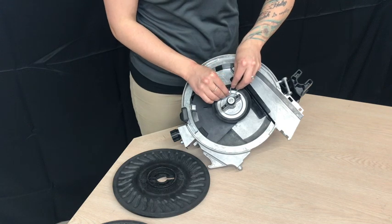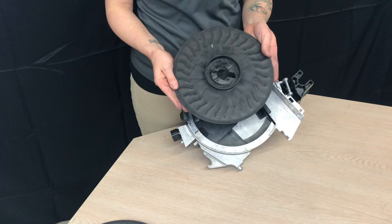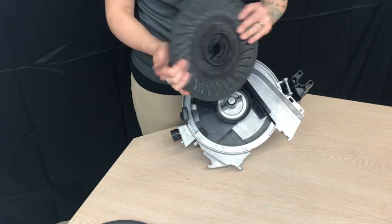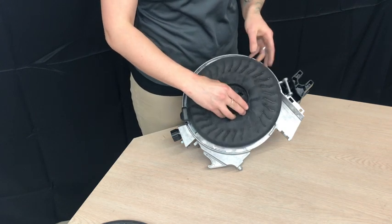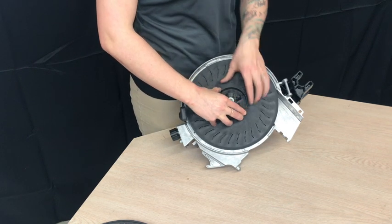Then put your clip back in. We want the plate to be tight against the meter when going from crop to crop. Insert the John Deere large cell plate and lock into place.